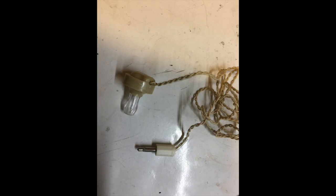Another type of earbuds you can use is the crystal radio earbud — actually a piezoelectric or ceramic earbud. There's a thin layer of ceramic with a piezoelectric surface mounted on top. This type of earbud has a very high impedance, around 5k to 10k ohms. The type displayed here is what is sold commercially, available on eBay or other online sites. However, these have a quality problem — the contact to the earbud tends to loosen, so you may hear something at one point and nothing at another. Try to pick a good one.